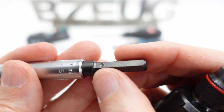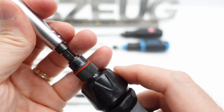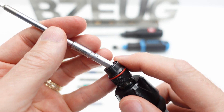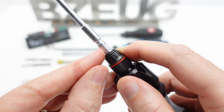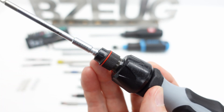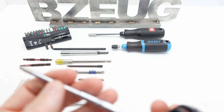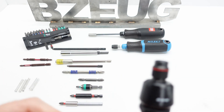This is a filo blade style, and because it's not notched on the corners, it doesn't actually lock into those six locking BBs in all the corners on the Matador chuck. I had really high hopes that these Festool bits would lock in here — they have a built-in stop so they won't go all the way into the Matador. I can feel those locking BBs catching those detents, and the dimensions would have been perfect, but because Festool flats the corners of the hex, it just slides right out. What a bummer.